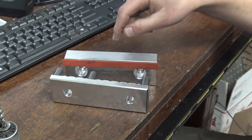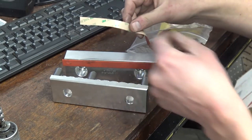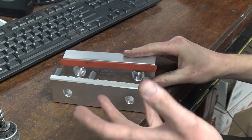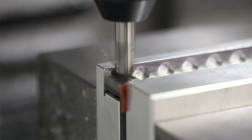So how can we make up for that? We've seen it done a couple of different ways, but the best way is some material that has a balance of flex and rigidity to help soak up any inaccuracies in part length. We did it in Widget 79 using an adhesive-backed rubber from McMaster Carr, which acted as a way to soak up what may have only been a few thousandths of an inch difference. It's a wear item and will have to be replaced. It worked fine for us for some period of time, but it depends on how much stress you're putting on the cutting operation and how much inaccuracy you're trying to accommodate. We've also seen similar things done with double-sided tape up to as complicated as closed hydraulic systems with a series of pins that balance out the load — really cool but getting more expensive and involved.